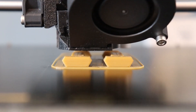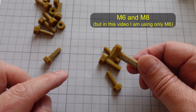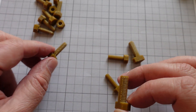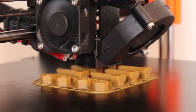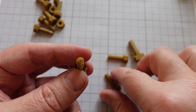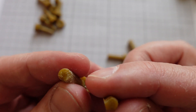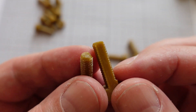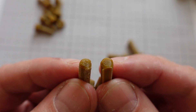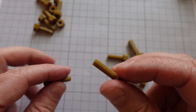Just for testing, four bolts are printed without supports. The surface grips better and sticks better to the printing bed, because with the supported version the thread is actually sitting in the air on supports with no adhesion holding it. So I always get some minimal warping. This version is much more rounded — all I have to do is clean the brim and I get a much better rounded cross section.